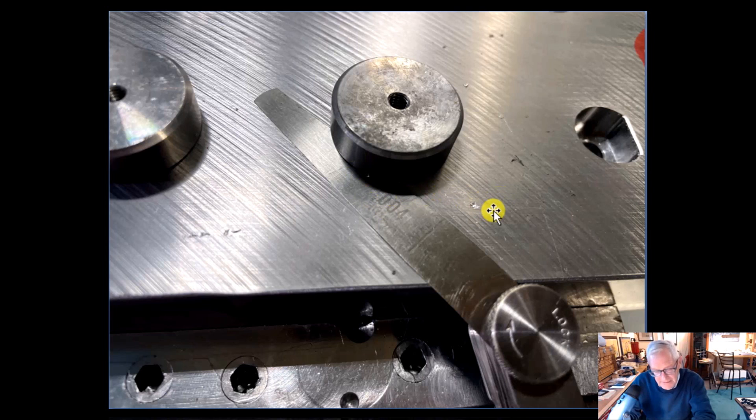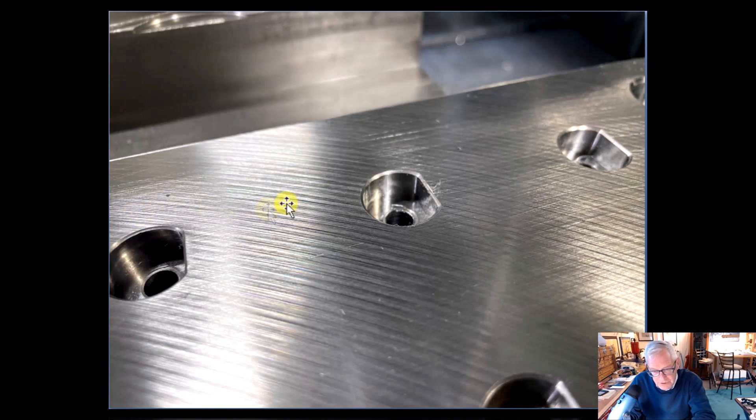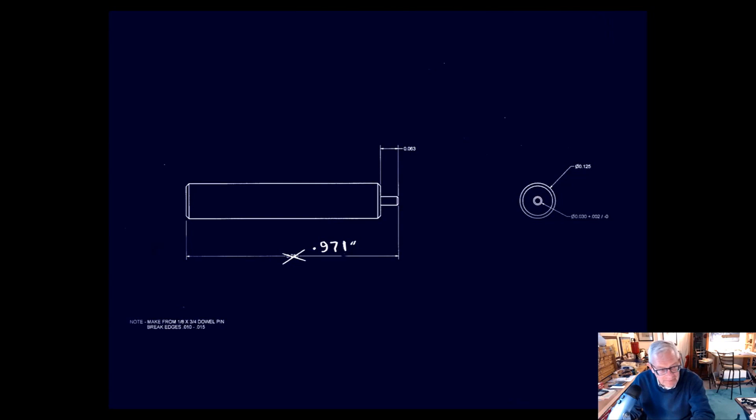That's victory number one — but Houston, we have a problem. They're not sitting flat; they're not going all the way down to the fixture. I could get four thousandths under there with my feeler gauge. This is a typical issue a toolmaker would have. The issue is: when they turned them on the lathe, they got about a 15-thousandths radius in the corner — that's what's holding me up. So we're going to push those two plugs back out and put a chamfer around the D-shaped holes, and that takes care of that problem.